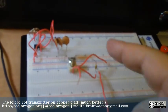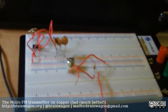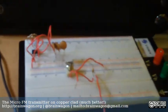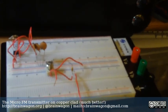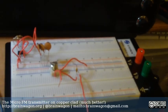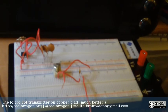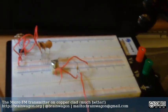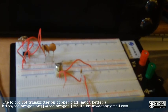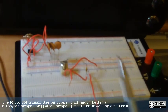But Tetsuo actually didn't recommend that we put the circuit down on one of these breadboards, and for good reason. As I mentioned in my video, these things aren't really that great for things that use a lot of high frequency circuitry, and certainly FM radio is up around 100 megahertz. So all of the wires and stuff here just throw off all sorts of stray signals, and it's really bad.